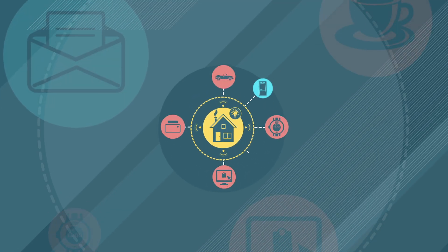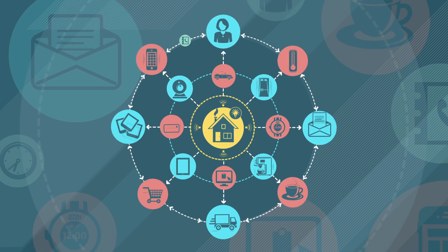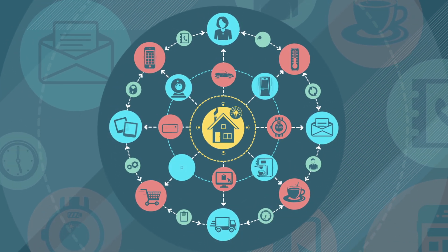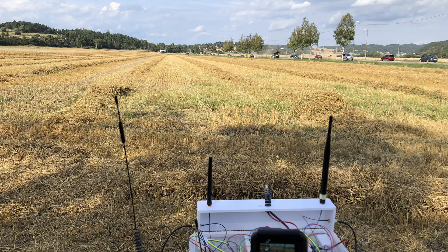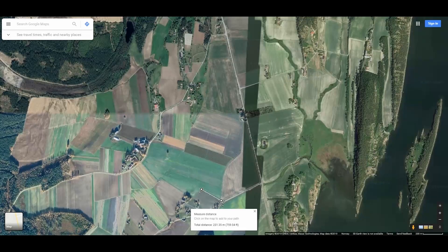But remember that the 433MHz band is a busy band, with lots of devices running on it, so don't use more transmit power than necessary. Back in the field, it was yet another sunny day. We were ready for a new test with hopefully better results, so we started off by doing a quick bike test. It quickly became clear that this was not going to be a new 50m range test. We decided to walk instead to get a more reliable result. Mike started the walk with just the spring antenna on the sender.